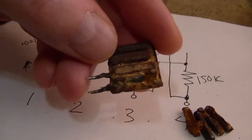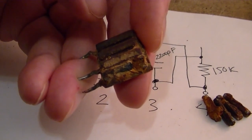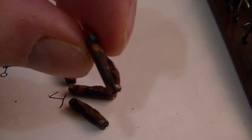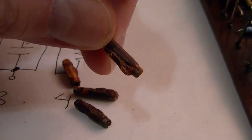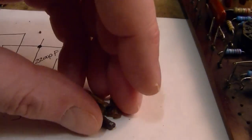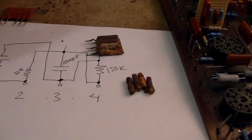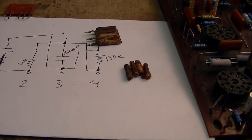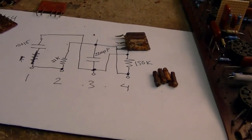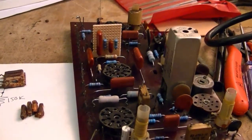As far as the material goes, the resistors sure all seem to be carbon composition. That's that black substance you see here. Capacitors are a little bit tougher to tell. I believe this is one. It seems to be some type of white ceramic tube, but they could also be tightly coiled paper caps. I don't think they're mica though. Micas tend to be done in flat squares or rectangles rather than coiled up like that. Mica is a natural crystalline material and it doesn't really roll up, so I don't think they're mica. Which helped guide me in what components I chose to use.